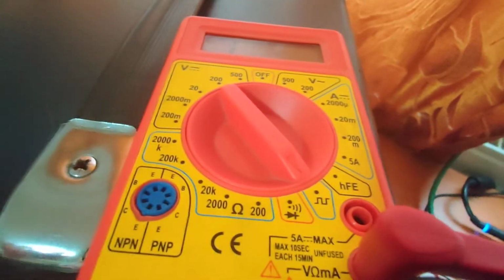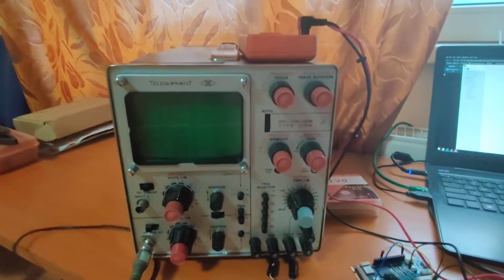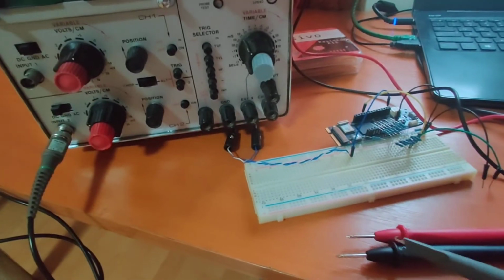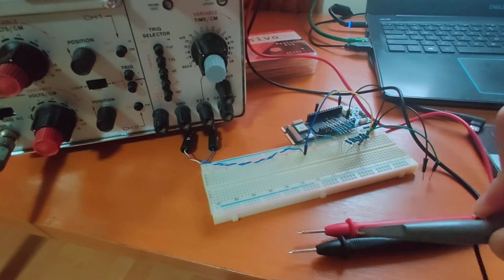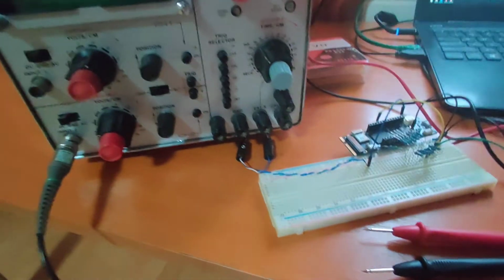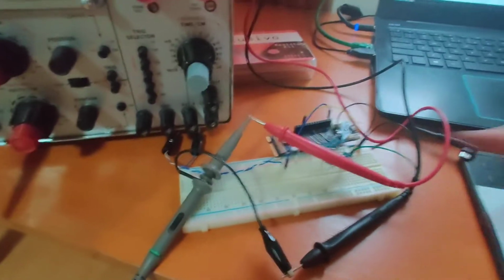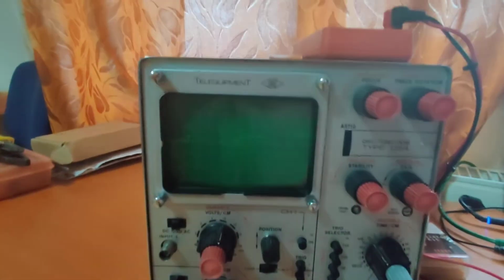I have a better one with this extremely cheap multimeter. It's like 5 euros, but it has this nice signal generator feature. I think it's used for checking audio amps and whatnot. It basically puts, I think, a 10 or 100 hertz, 1 volt signal across its two probes. And if I connect the positive, give me 1 second. Right, that's it. I connected the positive to the positive and negative to the ground of the oscilloscope probe, and we can see a square wave over here.